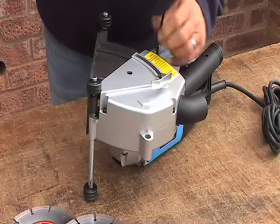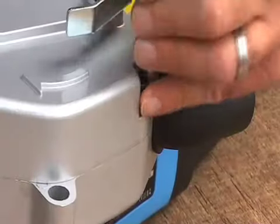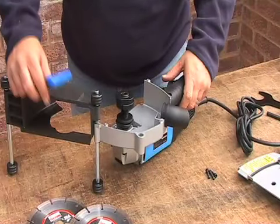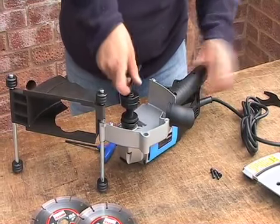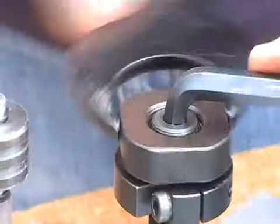The Premier Armour Products PC150 Wall Chaser is a light, easy to handle machine. Due to the unique way in which the blades are mounted, adjusting the width of the blade separation can be done without removing the blades. Additionally, this well thought out design also means you can cut a channel up to 45mm wide and 45mm deep.